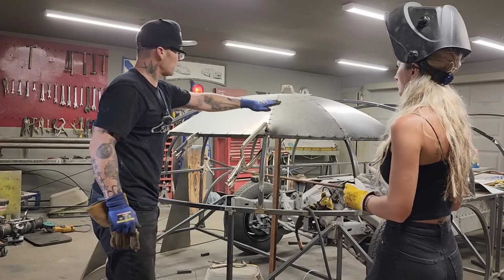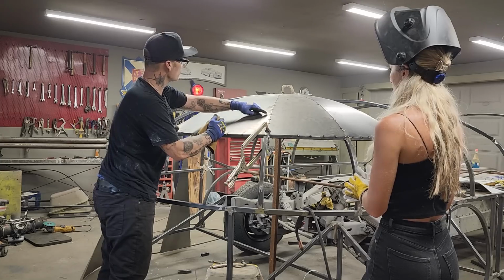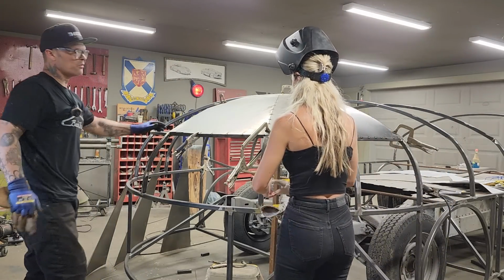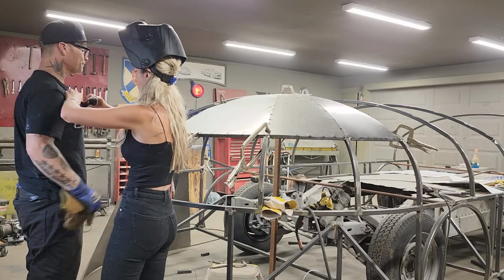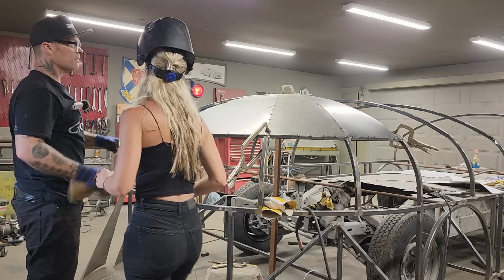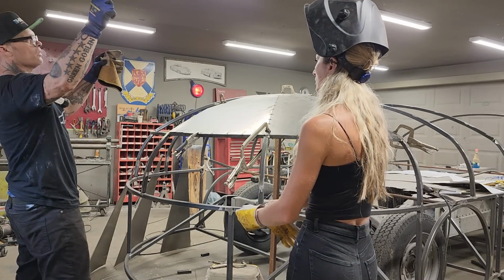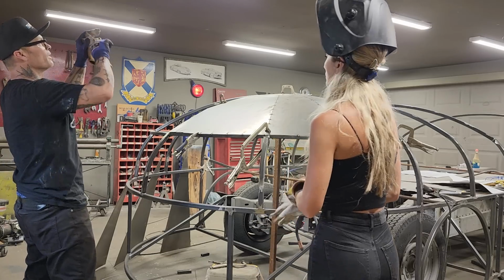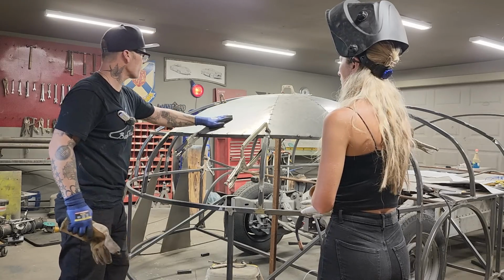And what's going to happen, like I said before, we'll get in there maybe with a piece of square stock, put a bend on it, apply one side, and then push it up in there. Just like if you were doing a roof skin and you rolled your metal and it came down on you a little bit, take a piece of square stock, put a little shape in it, get up in there, and apply it to one side where your roof is flat. Then you pry your square stock up where it has shape in it, and it would push this up and give us some shape. And that's basically probably what we're going to do there.